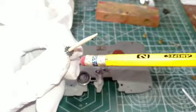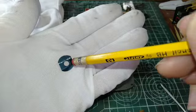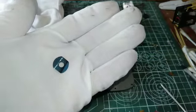Next is this leaf spring right here. If you make your own, as I pointed out previously, when you've finished, when it's still silver, take a blowtorch or just an igniter and blue it with a pair of pliers, like I've done in one of my videos, making another handcrafting a Bolex part. Heat it, make it blue just like this on both sides. Then after you've worked on it just a bit, submerge it into water and then heat it again. Okay, that will blue it, and so it will not rust. And just simply make the bends in it. That's it. Okay.